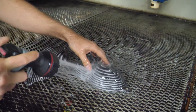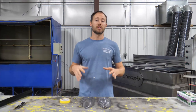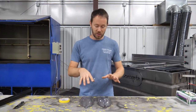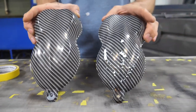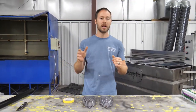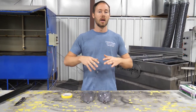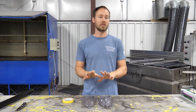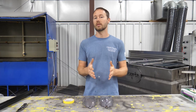If we keep rinsing, more and more is just going to keep flaking off. You can see that if you just keep rubbing it, it will literally just keep coming off — and that is not what we want. After everything is rinsed and dried off, you can totally see a big difference between the correctly activated part and the under-activated part. Same water, same everything — the only difference was that we just went faster with the activator spray. That pretty much encompasses what under-activated means, though there are a lot of things that can contribute to it.